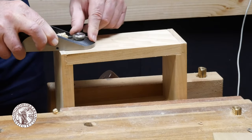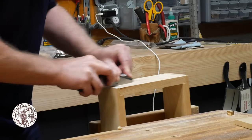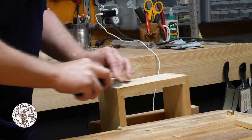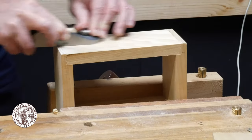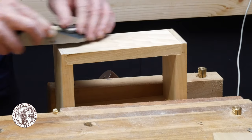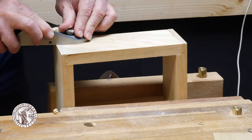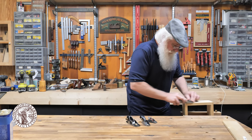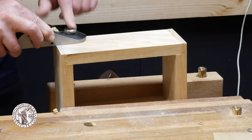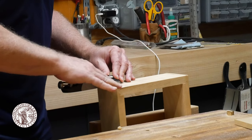You always want to go in towards the work piece, taking really thin shavings. Make sure to keep the toe of your plane on the surface of the work piece and check your progress occasionally. Always make sure the blade is coming out on the side of the wood where the fibers are supported — in this case going into the joint where I've got support on the back edge. I'm using a low-angle block plane here, which is especially suitable for end grain. Keeping the toe of the plane on the work piece helps automatically level the joint as you go.